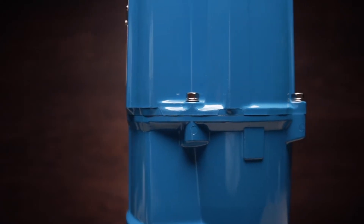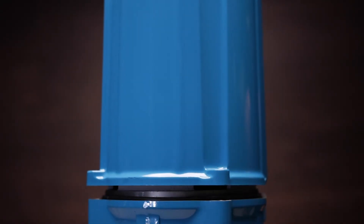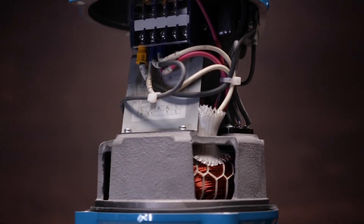The pump body is aluminum alloy and cast iron and houses a completely oil-free, air-filled motor. The body is two pieces and can be opened to access the wiring panel to rewire the pump from 115 volts to 230 volts. The process is extremely simple and can be done by the end user or by our Tsurumi factory authorized service center.